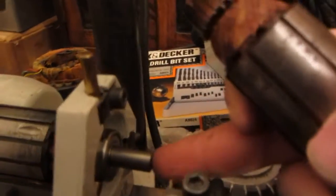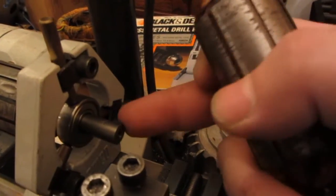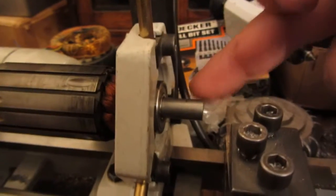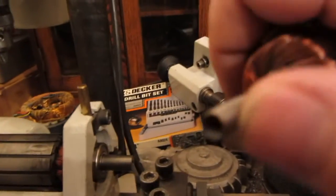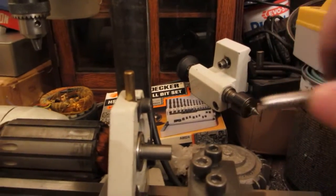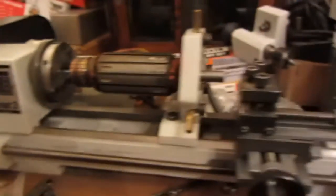What I've done is made a new shaft and pushed it on with the press. I've got a bigger bearing — 10 millimeters in diameter — and the shaft is 10 millimeters. The idea is to machine part of this shaft down to six millimeters, which is the diameter for the Unimat pulley to fit on. So this is my basic setup — let me just put that aside a minute.